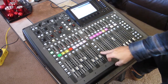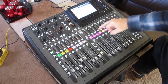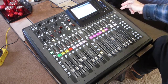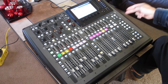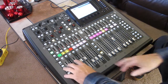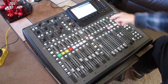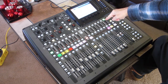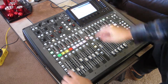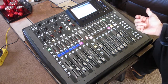In order to do that, I'll hit the matrix thing right here and hit the solo button. When I hit solo, you've got Sends on Fader — you push this, you solo that channel, and then you can monitor what the video feed is getting exactly. Of course you wear a set of headphones. Then you blend that mix as best you can. I'm using subgroup 8 to send to matrix mix 5, and I can remix whatever I need to bring up or bring down to get the right mix to the video feed.